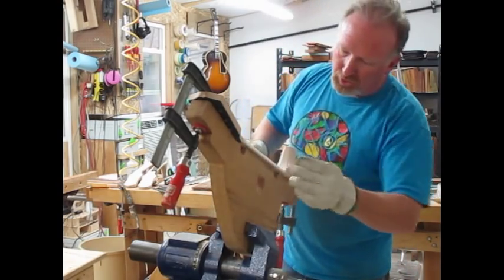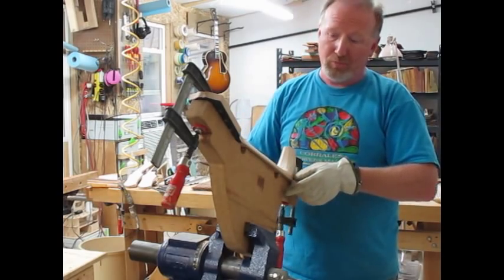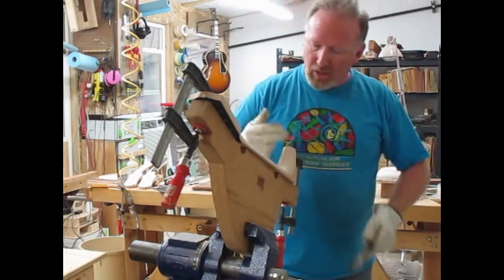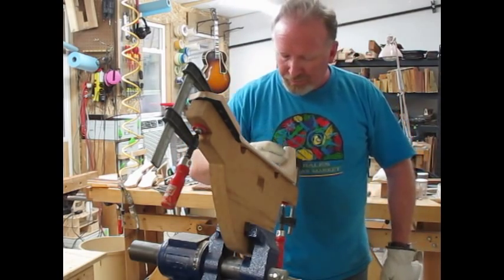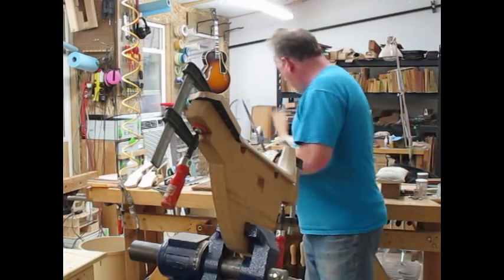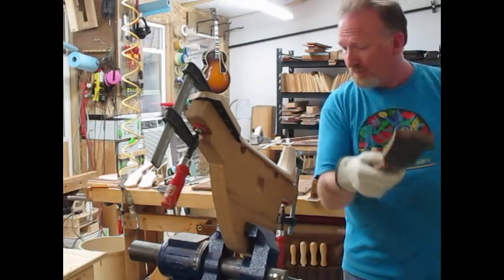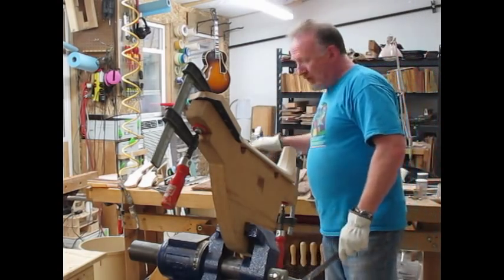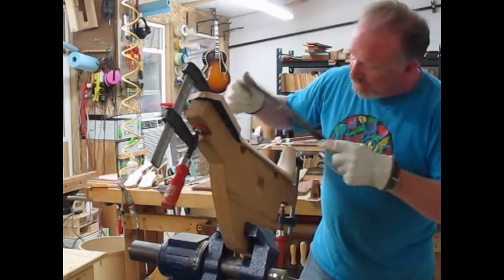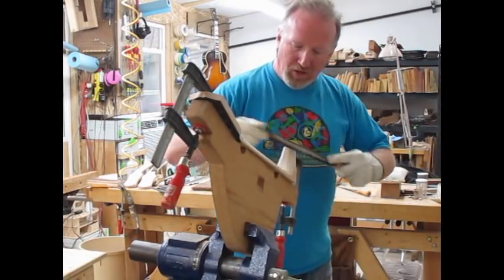At this point I want to be sure that I don't get too far in here and end up undercutting where the fingerboard will go, so I can't do any final carving yet. I want to bring this heel area — I'm going to use a French heel, so it will come to a point or a ridge like you see on this one. Essentially what we're doing is roughing out the shape.